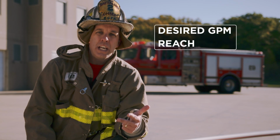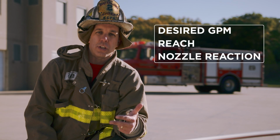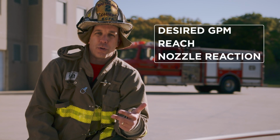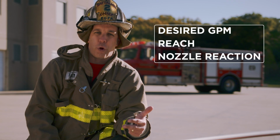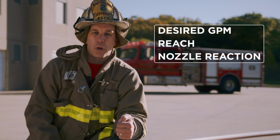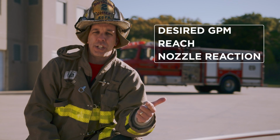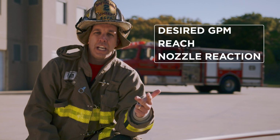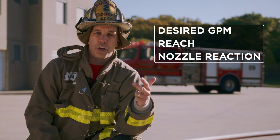And lastly, the one that still is very important is what's the nozzle reaction? What is the combat mobility of it? Is it a nozzle reaction so high that you're not going to be able to move beyond the threshold of the front door, move down that hallway, and get water to the seat of the fire? So understanding the 1, 2, 3, the desired amount, the desired reach, and the desired nozzle reaction to give you a nozzle hose package that will get water on your next fire.